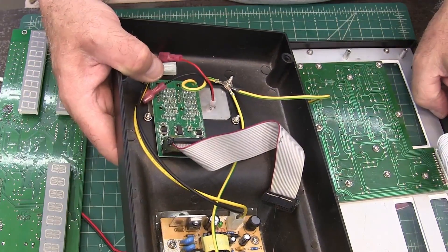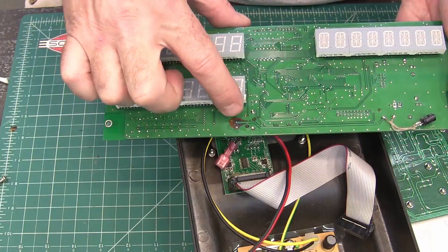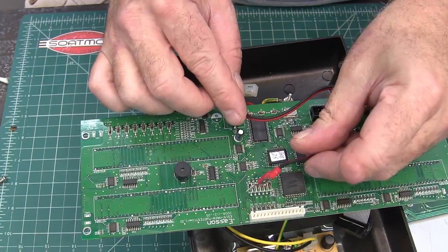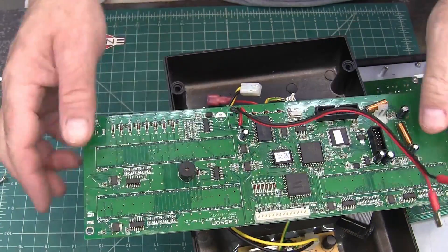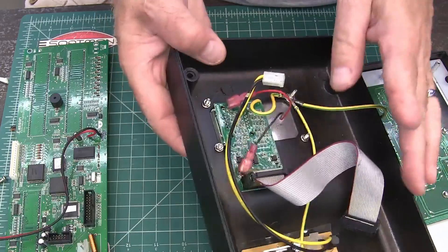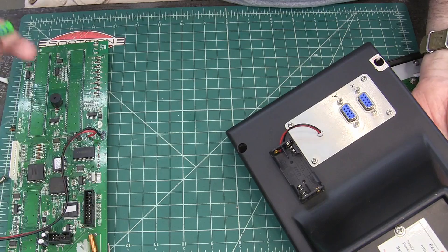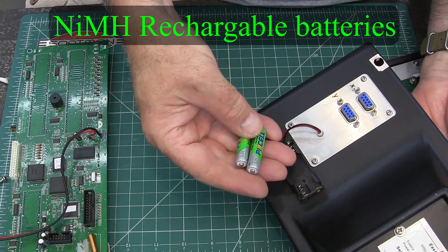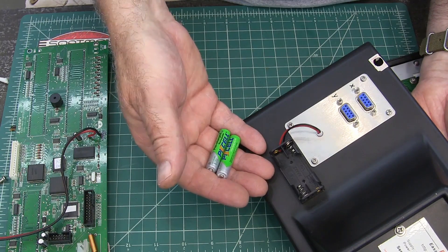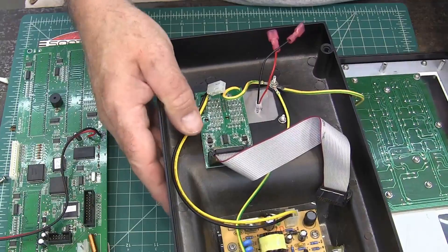I'm getting ready to put this back together. I have repaired the corrosion — there's a separate video on how I did that — and I've soldered in a wire to replace the battery. I drilled a little hole in the back for leads going to a little battery pack. My batteries are now going to be some triple-A's that I think are 800 milliamp hours, instead of the 60 that was in the original battery, so they should last longer. Hopefully I'll be able to charge them.